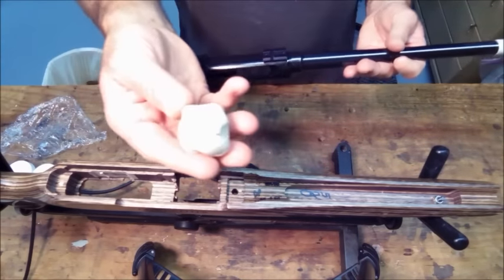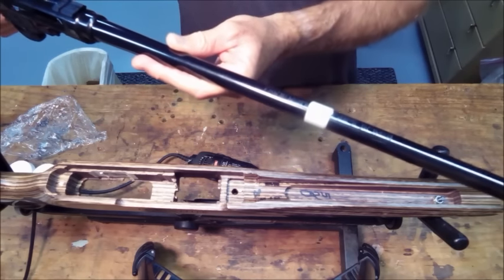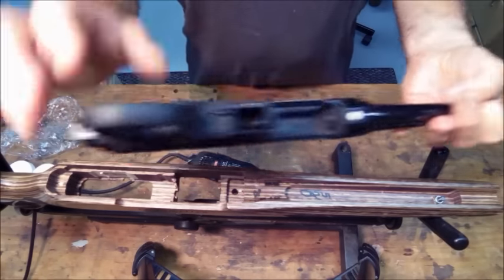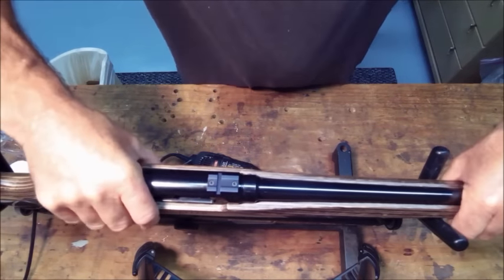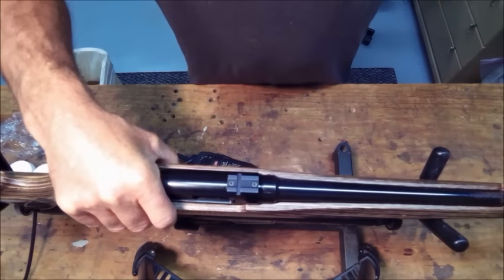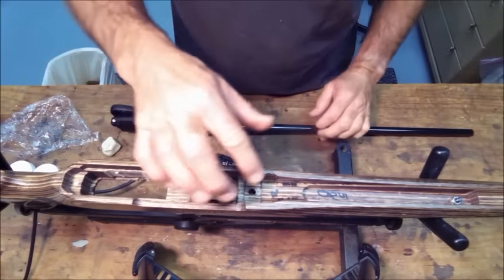How do we find that out? Take a little bit of your putty. I've already got the holes filled. I'm not making a 30-minute video out of this — I've just got done uploading a video about glass bedding a Ruger 77/22 Hornet. The mixing and all the details are in there, it's like 24 minutes long. I'm going to try to make this short. Take that putty, a little BB-size piece, put it right in there, drop it in and put it into its place. Squeeze her down tight — we've got good fit on our tape up here, keeping it centered, which is going to give us a totally free float. Pull her back out. You can see it's smooshed down flat. We have metal to wood contact.